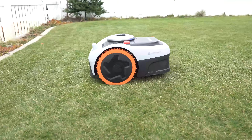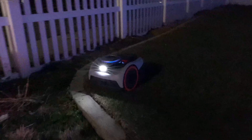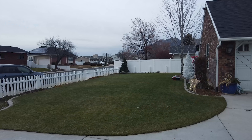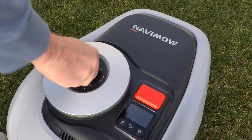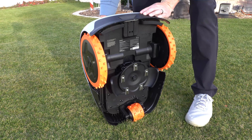As for the software, it's super easy to use. With the click of a button you can start a mow and customize what areas and the order of areas you want to mow. They've added options to enable mowing at night and turn the traction control system on or off. In the map management section you can set your mow direction and even set the direction for the next mow — one of my very favorite features. The mow direction UI is built like a compass now and it's pretty logical to use. But if I were to nitpick the product: the height of cut adjustments are static, meaning you can only adjust them from the machine — you can't change the height of cut through the app or per zone unless you go and manually change it.